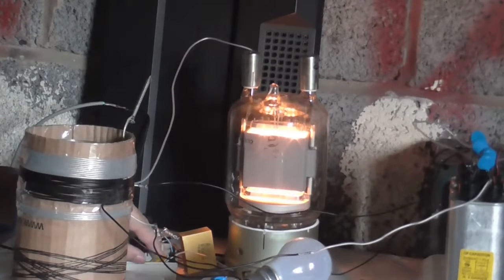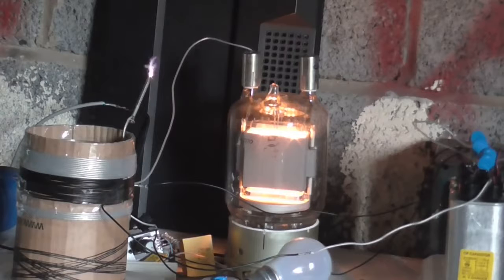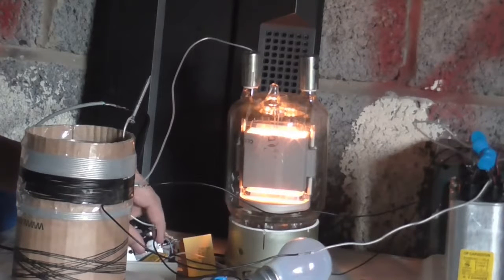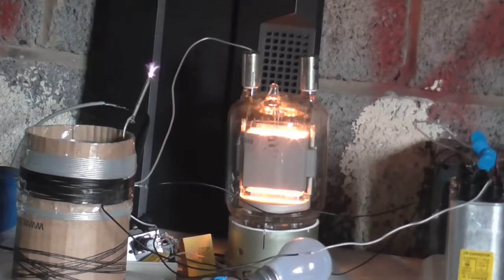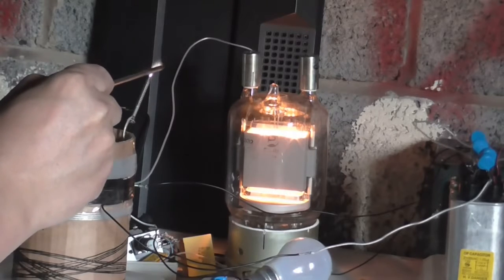Alright, now I'm going to move the potentiometer all the way over to the other side. It's about the same. So, now let's put it in the middle. Nothing. Absolutely nothing. Well, I mean, that's not nothing, but no sound coming out. So I don't know what's going on. I've tested the MOSFET to make sure the MOSFET hasn't gone shorted, and it's absolutely perfectly okay. So your guess is as good as mine on this one, even on really low power. I still got nothing.